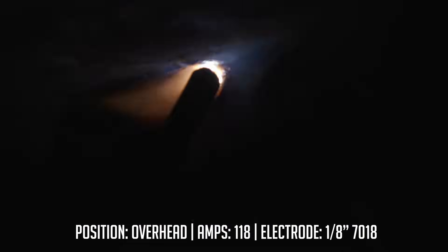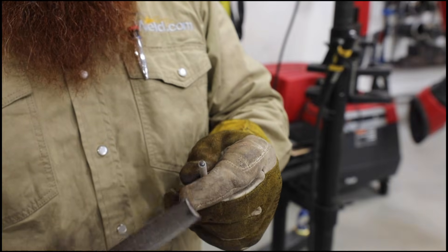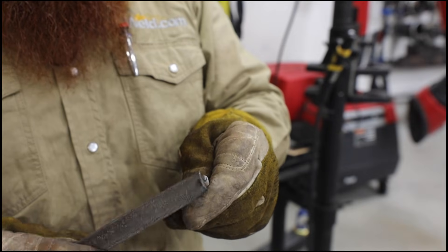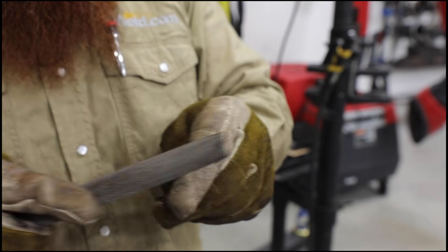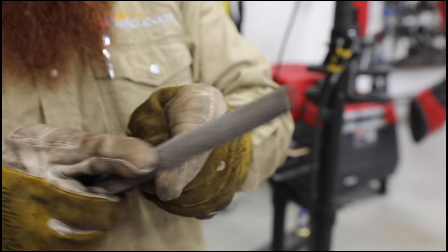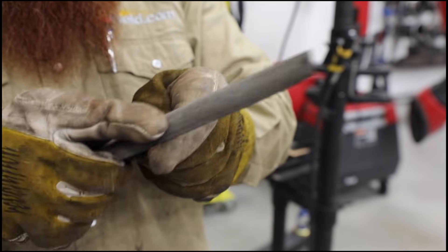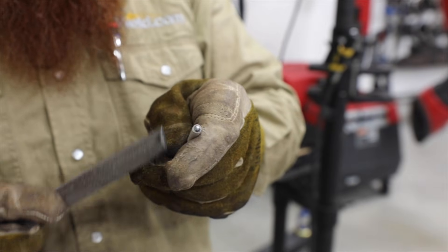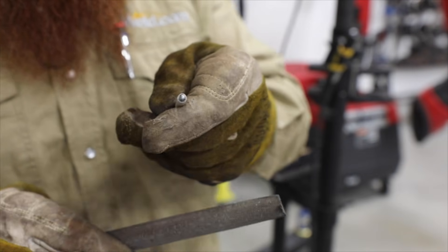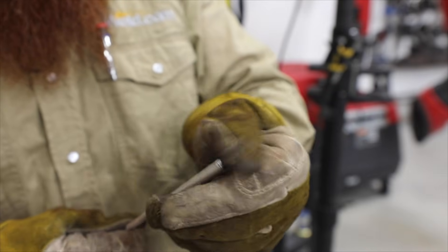Terminate on your own terms — don't let the rod dictate it, just whip right out. Now for a used rod: you can smack it on a table or concrete, but you risk cracking the flux on the outside, and you don't want to tear that flux up. Instead, just take a file and clean that back off to get down to bare metal. You can also file it down to get somewhat of a point — especially in a fillet or tight gap, this helps you ignite a lot easier. At a 45-degree angle you can get into that corner. In a groove weld you can stay pretty flat and tap to touch off, but in a tight fillet a little point on that rod is going to help you out quite a bit.